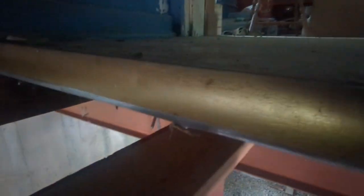See, the door wants to open into the basement, and I believe you can't clear the person off the top stair with the door when it swings in, so you have to have some amount of landing here. And so I'm going to stick to what was here to see if we can get it grandfathered, because we're going to have to pass codes and stuff here too. So again, for now, this is how we're making the choice.